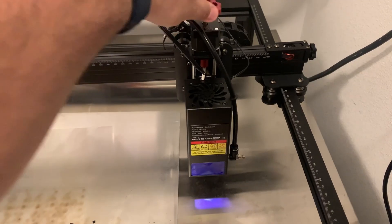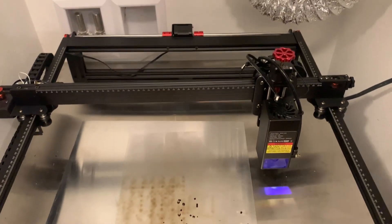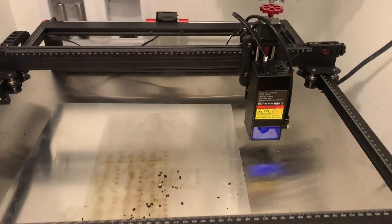This laser has an auto focus with a preset for three millimeters, using a Z motor to move the laser up and down until it's focused correctly. When the laser is at the perfect spot, it has the smallest beam — a small kerf — which means your puzzle pieces will fit together tighter and better. It also has an air assist, which lets you cut cleaner and smoother, reduces charring around the paper, and even lets you go a little bit faster.